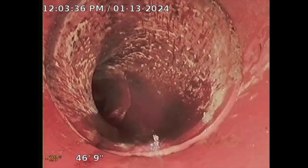That's the city drain — city sewage there. Good news: I don't see any major issues. Usually it doesn't take much to visualize damage, cracked pipe, or sewer that is blocked or obstructed because you would see it. I'm getting a good picture here. Now I'm just going to retract my camera and come back dry. I turned off all the water fixtures.